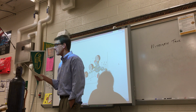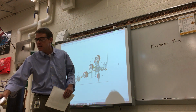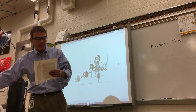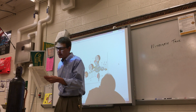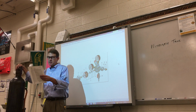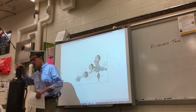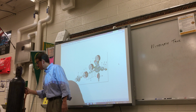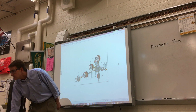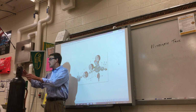They're only one piece of a two-part system. So this is one piece. This is the second piece to the two-part system right here. All right. Without a correct regulator or manifold, it cannot function safely. You got to know how to safely install and remove that regulator from the system. Make sure they're properly secured when it's stored or when in use. So this is secured right here. It's on a cart. Okay, it's just a small 9-inch base on this tank, and it is a little top heavy, especially once we put the regulator on.